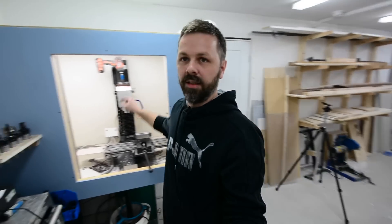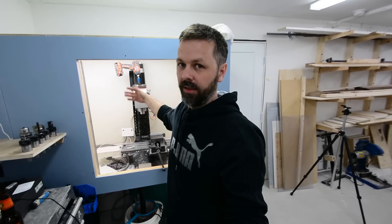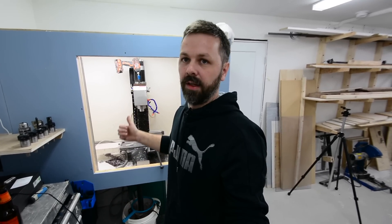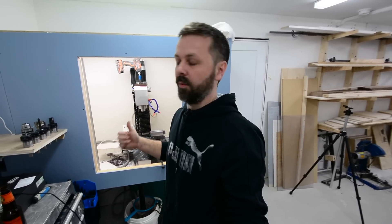So what's next? Well, hopefully now that I got the machine dialed in I can start cutting out some flip stops. But one thing that definitely has to be done is the motor has to be upgraded. It just comes with this little one horsepower motor, which is probably fine as a regular mill but for CNC it can't handle it — it's going to fail. It's not a matter of if, it's more about when. I already got a motor for it — it's big, it's going to be fast, I can't wait. So I've got to work on getting that thing converted for a bigger motor. Anyways guys, I'm Ryan Nuggle. Thanks for watching.